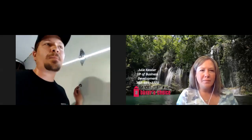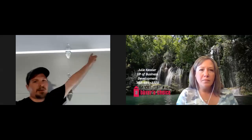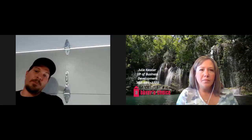All right, so once you've got it released from the opener, lift it by hand about halfway. If the garage is balanced properly, 90% of garages you're going to be able to lift with one hand, just like I just did. I did my left hand. I'm right-handed, so it was really easy. So you want to get it to about the halfway point where you're going to see the brake in the middle here. This is halfway up. And if the door stays up halfway without falling or going up, that's good.